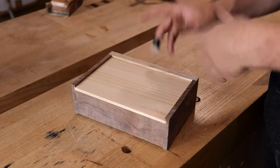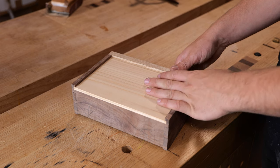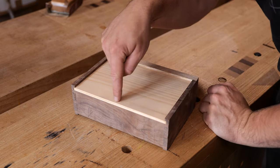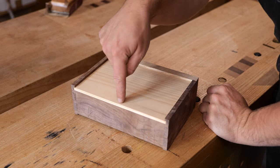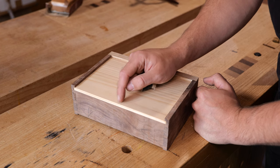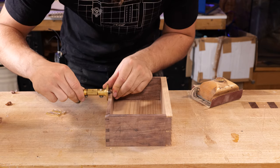Because this base is solid wood it's obviously going to want to expand and contract. Fortunately cedar doesn't do this too much, but the general way of accounting for this is to screw the bottom of the drawer into the back from underneath and give it an elongated slot hole — in fact we're going to aim for a slot that just comes out the back entirely.